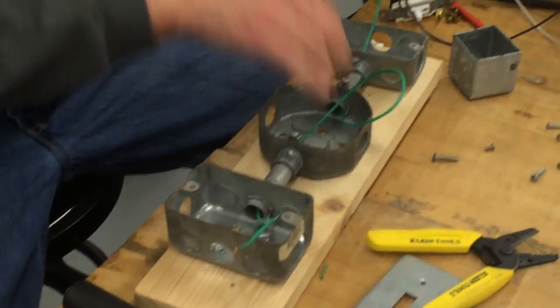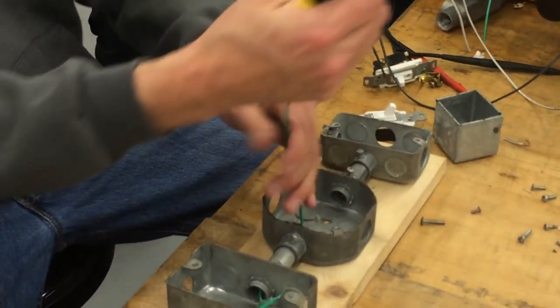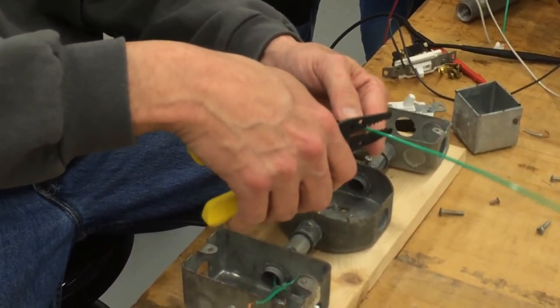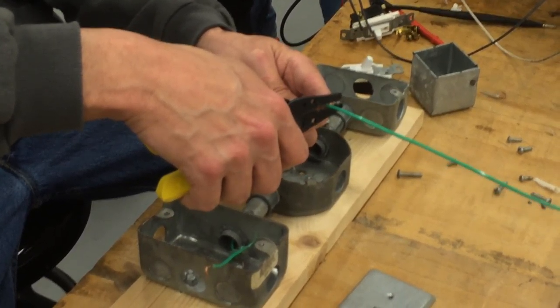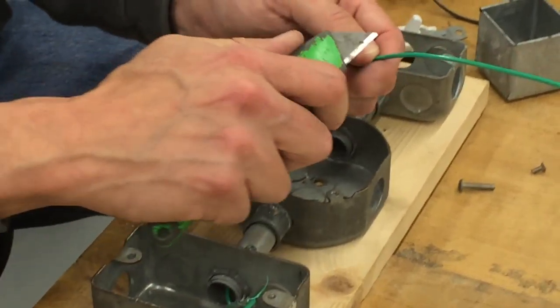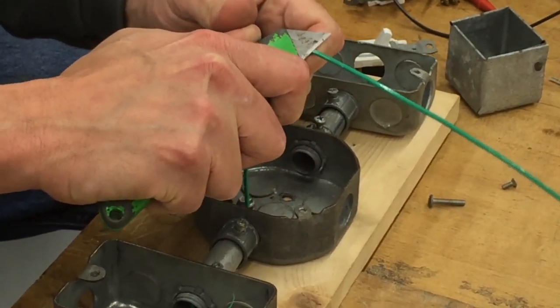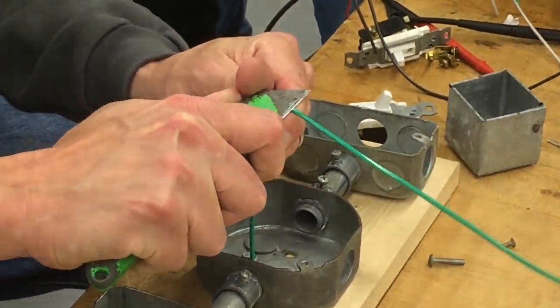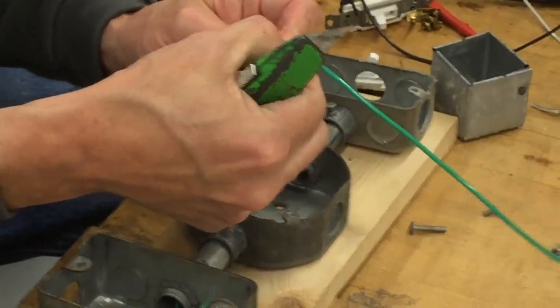Still need to do one here, and I'm going to need about six inches back here. You could also — sometimes if you want — you can just cut the wire insulation in two different spots, and then some guys can shave it. You can shave it like that. And once you get it to the next cut, you should be able to just peel it off. So that's one way of doing it, to get a piece out like that.